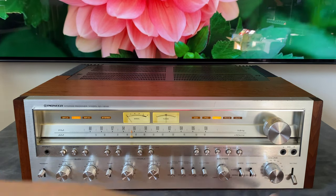So you really don't hear it click because it happens so fast and happens simultaneously with when you power on the unit. The click that you're really listening for is that couple seconds after power on, this guy right here will click. That's the speaker protection relay. If that doesn't click, it usually means that there's something wrong with one of your two output stages. It can happen where something is wrong with the circuitry itself in the protection circuit, but it's more likely that something has gone out of spec on one of these output channels that's keeping it from engaging.